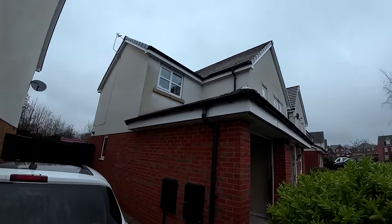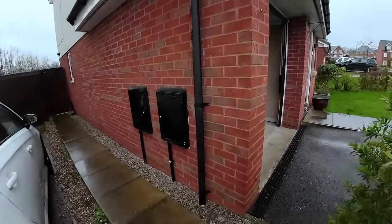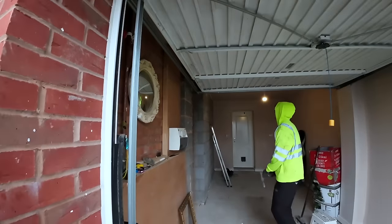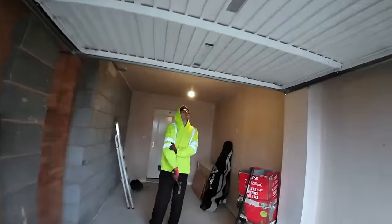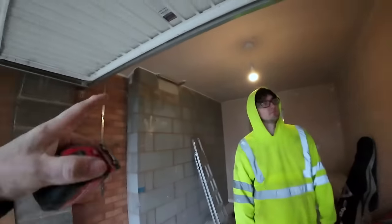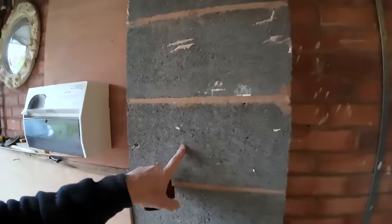So, yeah, the padstone's set back there. The front of the house comes across there, not here. So, we haven't got a padstone here, which I thought we did. Just roof space here. So I don't know what this pillar's here for. I thought that was something to do with the front of the house and the padstone, but anyway, this is coming out because it's got a cold bridge now, and this is going to be made into a cavity wall.